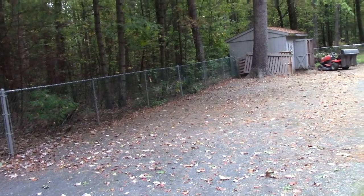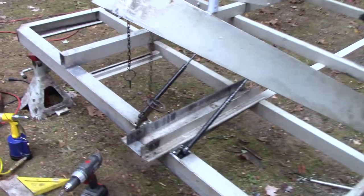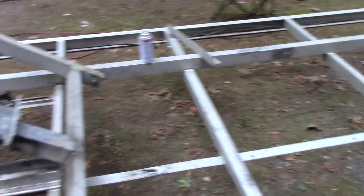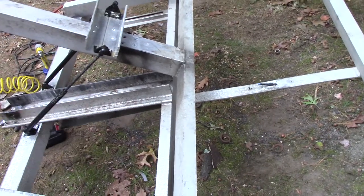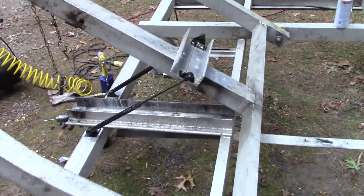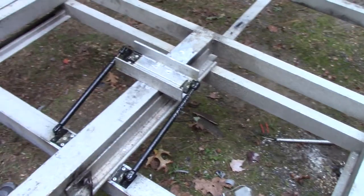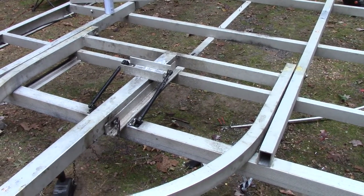I want to tend to this other area first because it's easier to access upside down. I moved the bracket up - I cut those ramp holders off the angle iron and now instead of the steel plate that was in that bad hole location, I moved it up a little bit which actually gave me more lifting power. Now if I take this trailer over to New York my friend can put a bead of weld on there - would be stronger than pop rivets. Next I want to flip this right-side up and attack that axle.